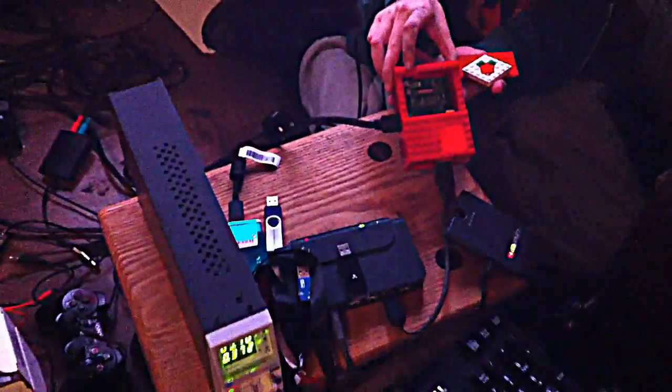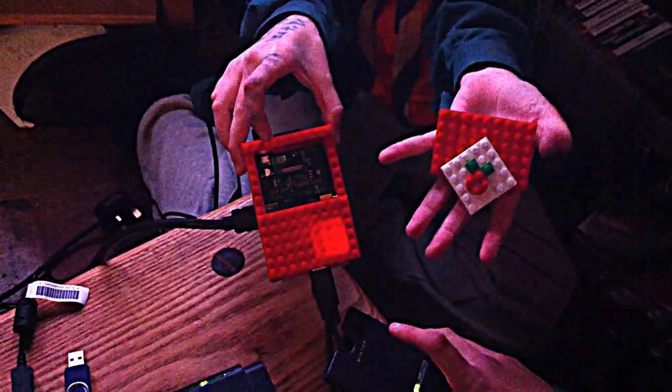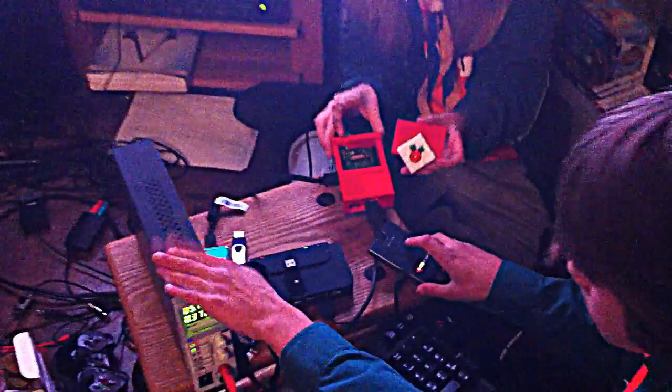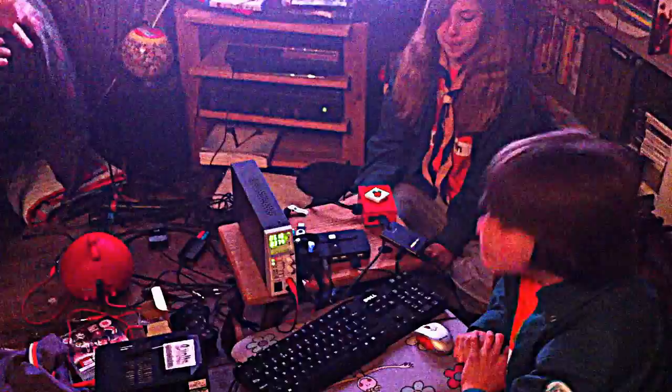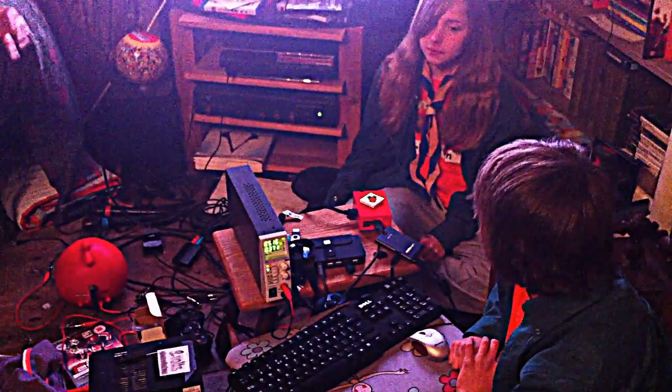It comes just as a bare board and we've made our own case. The case is well made - it comes with a lid so we can access the test points for the power supply. Like most people, we've had some problems with the power supply so we're using a bench power supply at the moment. We can get everything to work - keyboard and mouse which always works, and then we can get Wi-Fi and Bluetooth to work. Not all at once unfortunately, but there are some software fixes to come so hopefully that will all be ironed out by the educational release.